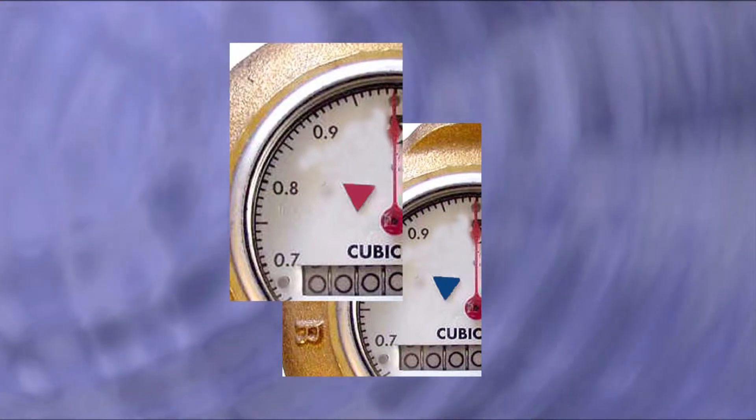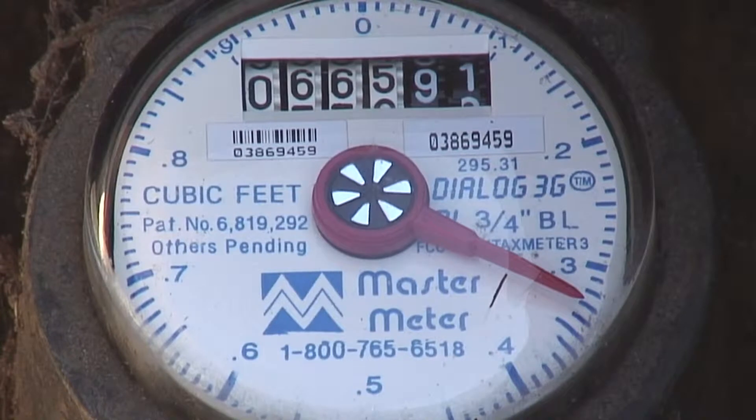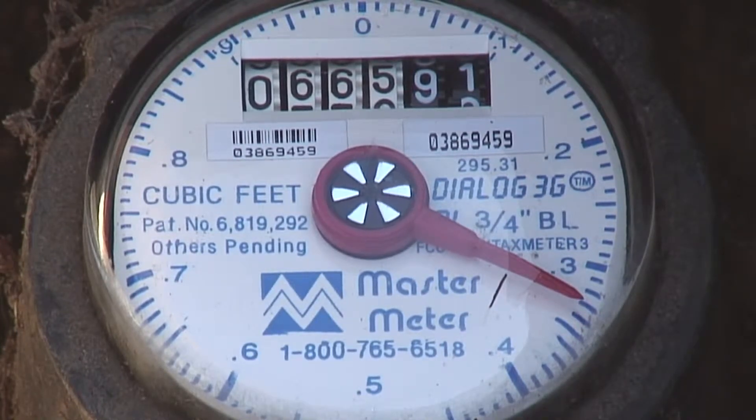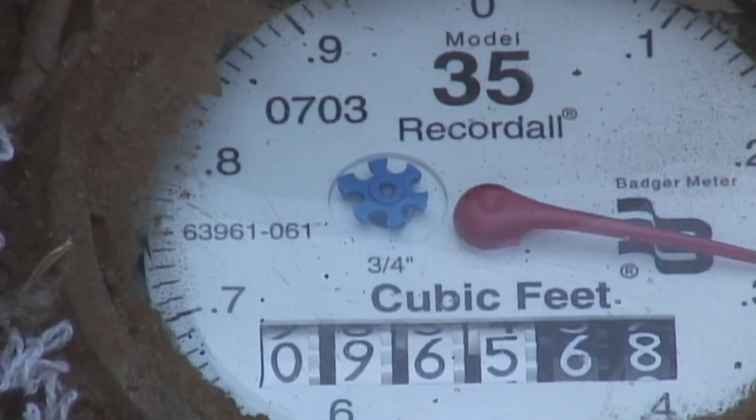The indicator can have a slightly different look depending on the water meter installed. It could also be a red or blue triangle or a silver asterisk in the center of the dial. Whatever the shape or color, the working principle is the same. What you're looking for when you open the meter box is: if you have all the water turned off inside the house and outside the house, and you know the ice maker's not running and there's no water going on at any place in the yard or home — if that indicator is moving, you have a potential leak. In this case, the blue indicator is still. No leaks are detected.